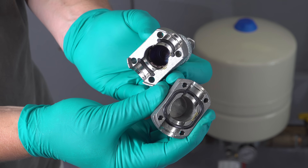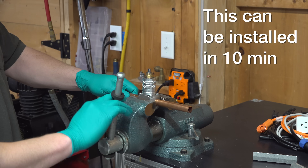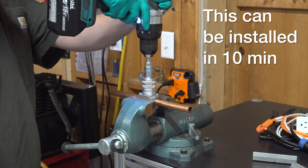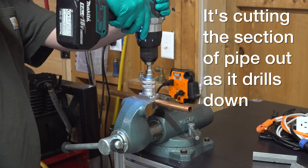There were many questions from folks saying why not just use your water main? Well, if you've got one, you don't need to buy this valve at all. This is a last resort valve — meaning you don't have access to your water main, or you might have a situation where you've got a rental and maybe half your building needs to have the water turned off. Use one of these and you could stop the flow of water anytime without interrupting the main service.